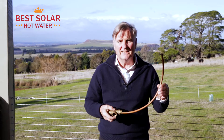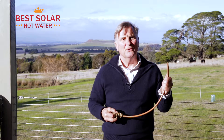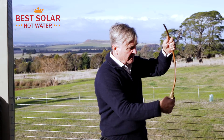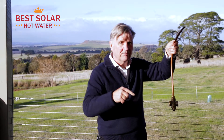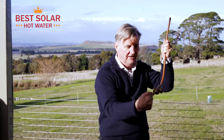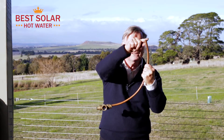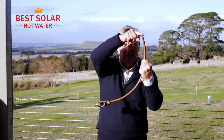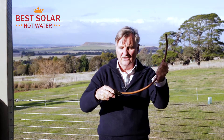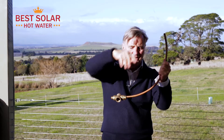The way this works is that it converts your cold water inlet in the tank to a cold water inlet into here. A solar flow goes into the pump that pumps it up into the solar collector on the roof and it returns into here. That pipe continues up and goes into the midpoint of the tank, so you're not circulating the same water all the way through — you're taking the cold water from the bottom of the tank and returning the water to halfway up the tank.